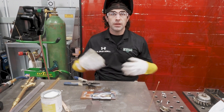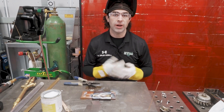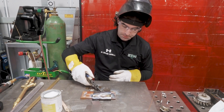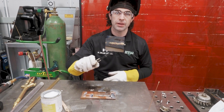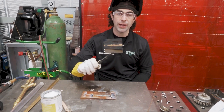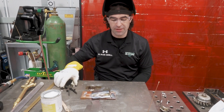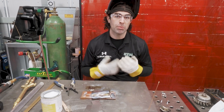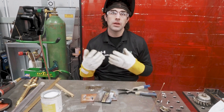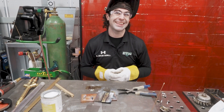That's all there is to it. I've got a braze weld — of course it doesn't look super great; the filler metal tends to just run wherever it wants to. On the back side we can see where it went underneath the joint and filled out pretty well. This is nearly as strong as oxyacetylene regular welding — tensile strength is going to be about the same, except at high temperature. After a couple hundred degrees this bronze will lose most of its strength. But that's the basic process of how braze welding is done.